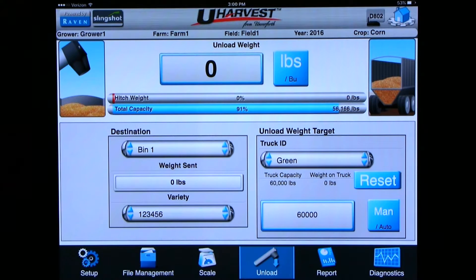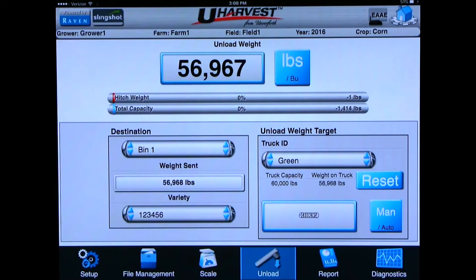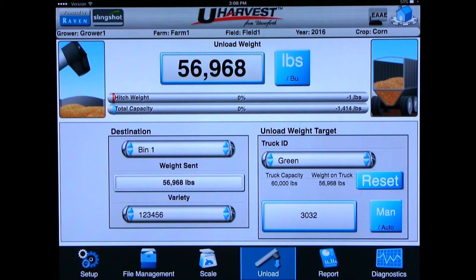With the tractor at idle you can go ahead and engage your PTO. You can now see grain coming out of the grain cart spout on the left side of the screen and grain going onto the truck on the right side of the screen — this means you are in a loading sequence and the system is recording. The unload weight zeroed as soon as the PTO was engaged. As you unload the grain cart you will notice the weight in the unloading box starts to climb. When the truck is full and you disengage the PTO, do not move the cart until the PTO stops spinning and the weight is recorded, as moving too soon will make the weights inaccurate. You have unloaded your first load and can go back to the scale page to see the loads you just dumped.